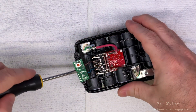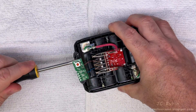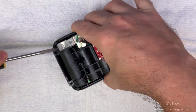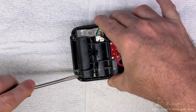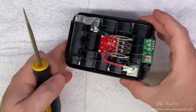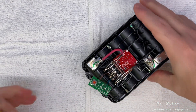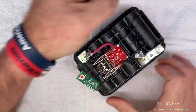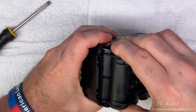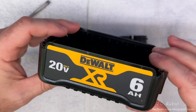All these components are really press-fit into the bottom of the case, so I'm going to use a flathead screwdriver to gently pry on one side, bringing it up a little, then flip it around and pry in the corners on the other side because there's no room in the middle. I repeat the process over and over, raising it up evenly, until it comes out of the bottom of the case. The case bottom won't be needed, so we'll put it off to the side.